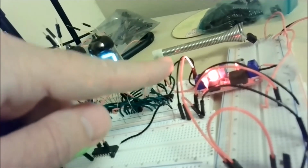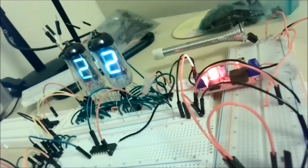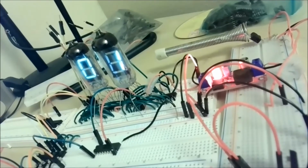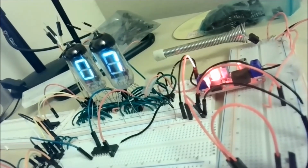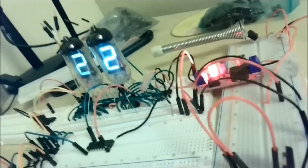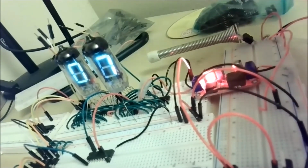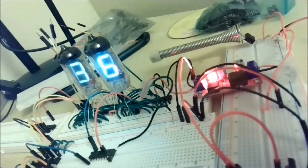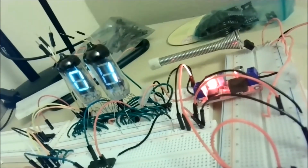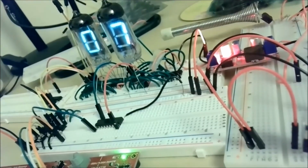Okay, so that's all good, but I needed a regulator for that because I have to step up the voltage. So you need one of those chips that will boost it. And then for the 1.5 volts, I was just trying to use a 317T with the resistors set to 1.5. But it turns out that this thing was getting so hot, it literally burns your finger. If I go over here and even touch this part, it burns, it'll burn my finger. It's so hot, and so I'm trying to figure out why it's so hot. That was definitely one of the things I was trying to figure out.